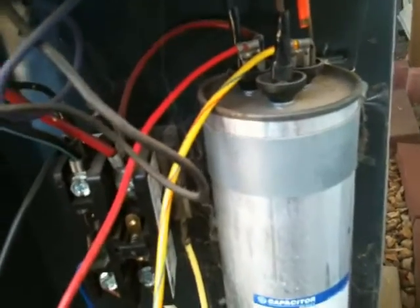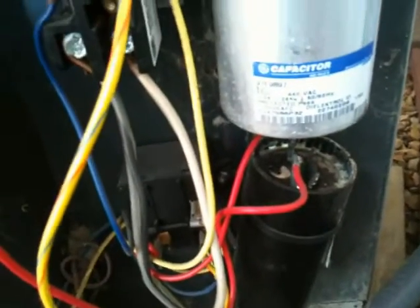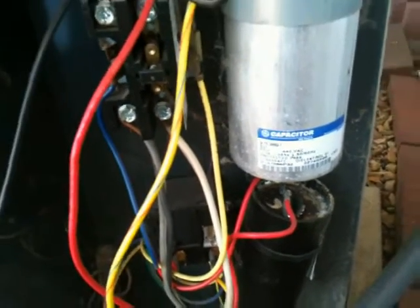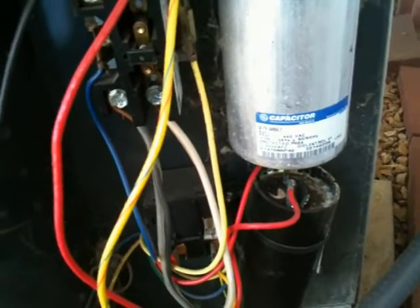The system's still running fine. I'm going to cut the power and check the capacitor, and we'll reinstall the new hard start kit, which I have in the house. I always buy two of everything when I get a chance for my own system. Then we will do a little test run — an amp draw and everything.